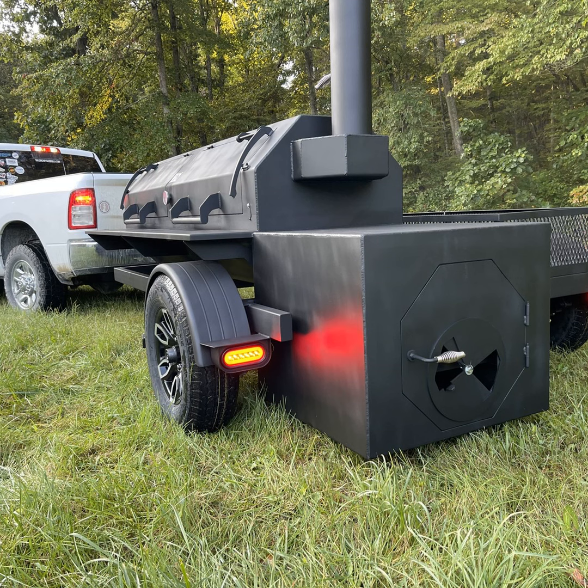If you look at a lot of the stick burners where guys are building their fire on the bottom — on the ones I've built, you'll see the door opens and there's no door lip down there at all, so you can easily clean out the ashes. More importantly, if you build your fire directly on the bottom, you want your air to come in equivalent to or directly at that coal bed. That way you can get air mixed into that fire. The second part of that is you're going to have to continually spread your coal bed out and clean the fine ash out of it every once in a while, so you've got coal bed and not ash choking out the fire. The more accessible that coal bed and chunks of charcoal and wood are to the air going in, the better and more consistent that fire is going to burn.